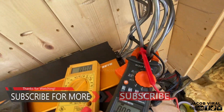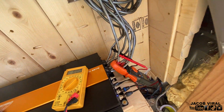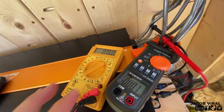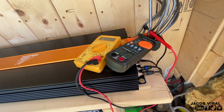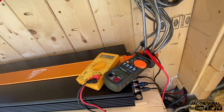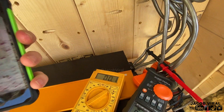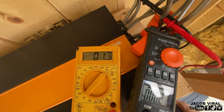You clamp the positive and then you have the voltmeter hooked up to your negative and positive of your speaker wires. What that does is let you multiply the two numbers to see how many watts you're clamping, and then it's going to tell me how much impedance rise there is if I divide the numbers. I'll have the clamp meter measuring amps, and then I'll use my meter to measure where I am power-wise. So that's 49 hertz and we'll see.